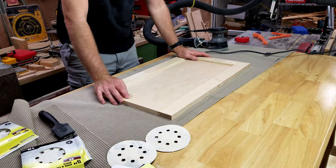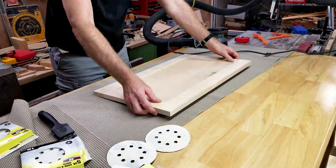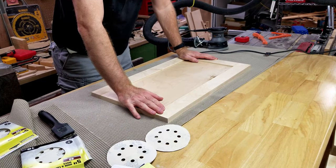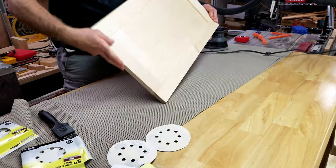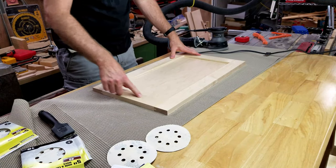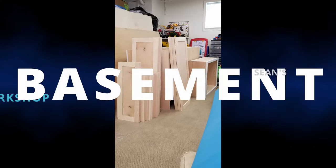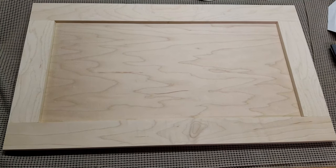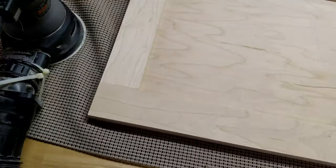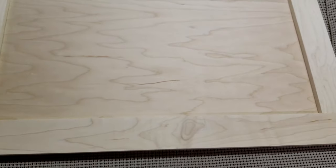The panel's sanded and everything's good on the inside — it just needs these edges sanded up front. I'll start with the back side first so that any accidental bumps or scrapes from material go on the back of the frame. The front I'll do last to end up with a nice smooth finish. Here's my door face after sanding — each joint is fairly nice and smooth. I'll continue taking the rest down to 80 grit.